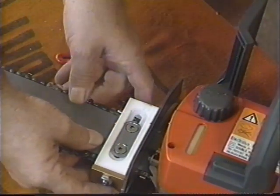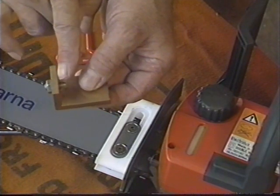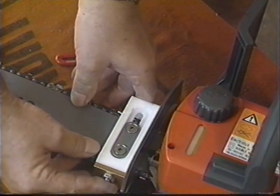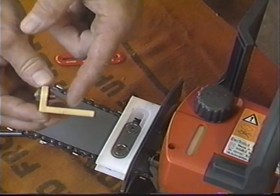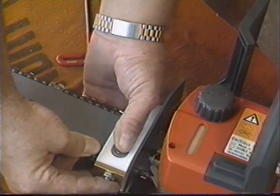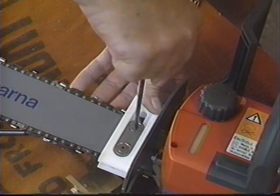And if you can get to a point where you can hold all that together and just take it right on in to where that dog point set screw is. And by the way, this is adjusted right now to where I've got 1/4 of an inch from this face to this flat face on this set screw. So I'm going to hold that in there, and it's going to go right against the cutter tooth, and if I've got it tight against the back, it automatically gives me the 90-degree setting for both of these guide plates to be right directly across from one another. So we're flat against the bottom, we're back against the cutter tooth. At that point, just simply snug it down, and you should have a pretty close adjustment.